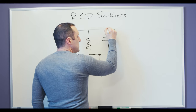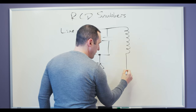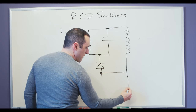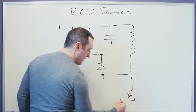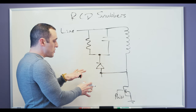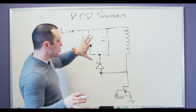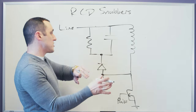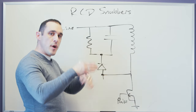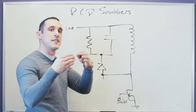Now if you look at a typical DC-DC converter, you will see the top of this is connected to one of the ends of the transformer coil, and then here we have a connection over to the diode, and then down here we have our connection to our FET, here we have our gate, and this is our PWM waveform coming in, and then this basically just goes to ground. This can also be used in a push-pull converter, which uses a center-tapped transformer that puts a duplicate of this circuit in parallel with a second FET, also driven with a PWM waveform. Those two waveforms push power through each of the two coils, and then that couples to the secondary side where it's rectified, giving you a DC output.